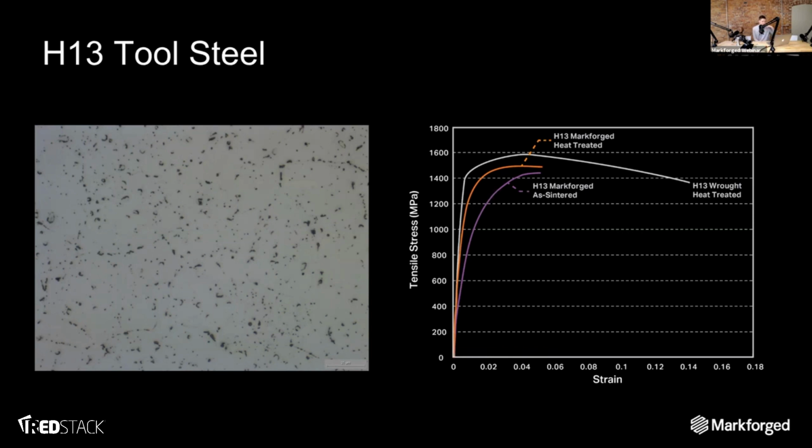I guess the one thing I want to talk about before opening up the floor to questions and opening a dialogue with you and Marco and just letting you ask stuff is the heat treatment procedure. So 17-4 is usually annealed. There's a number of heat treatments you'll see for 17-4, and H900 and H1150 are the two most common. We prefer H900, but as a whole, 17-4 is something where we recommend you heat treat it, but it's not necessarily required for the applications you're looking for.